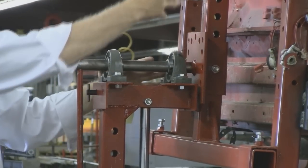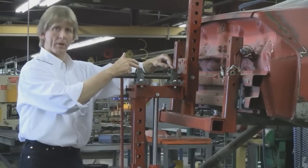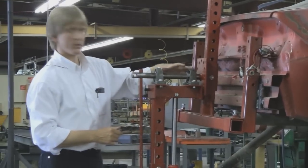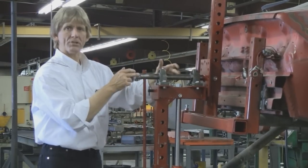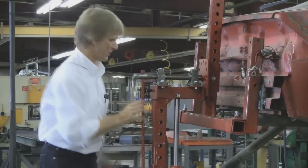We've got industrial bearings here. These are pillow block bearings. There's two on this side and there's two on the right hand side that you're not seeing in the camera. You're going to have two greasers, one on each of the pillow block bearings. You're running on one main shaft that's hooking all this together. That's your center line and that's what allows this thing to spin easy.